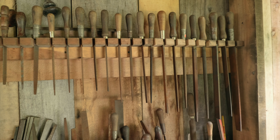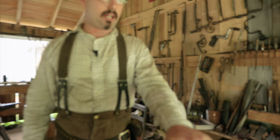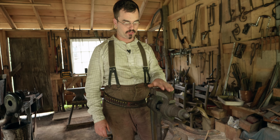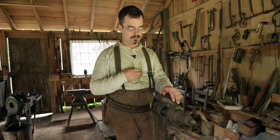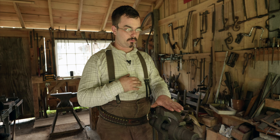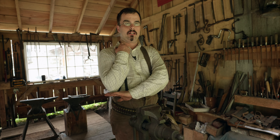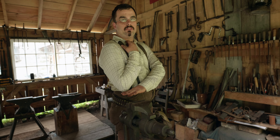So let's look at what I do with these files and talk about the vise too. This is a post vise — you can do file work in a lot of different kinds of vises. But generally, a good rule of thumb is that for most file work, the vise should be set at elbow height. So if you stand straight, the vise should come up to your elbow.